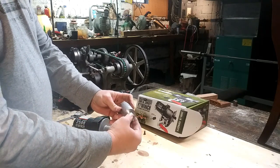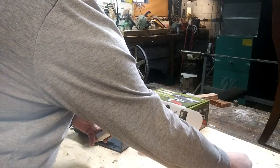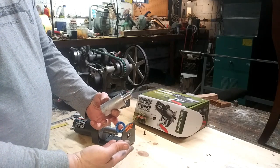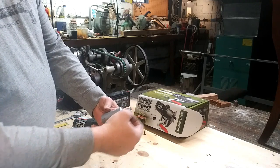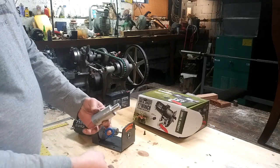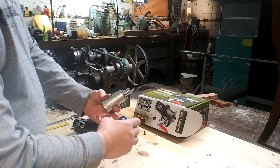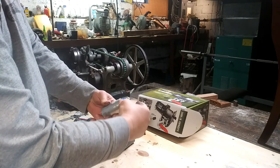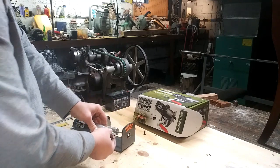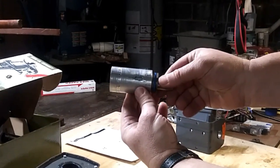The size, which is a little less than 0.75 inches, we're going to use this very inexpensive axial bearing that's going to allow us to spin this shaft while the pull of the sail is on. You never want to put a bearing or any kind of moving surface on aluminum and steel because it's just going to gouge the aluminum and bind up. So we're going to use these washers that come with it — put that on like that — now we have a bearing surface that will spin. It goes through here. There we are. Our slot.